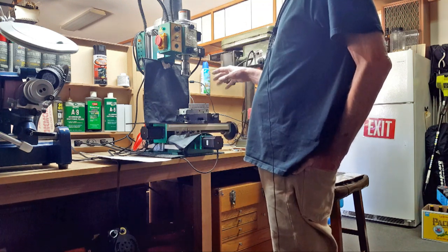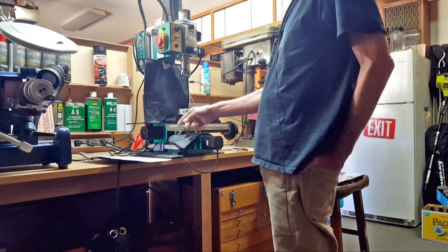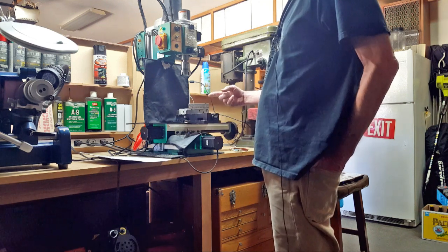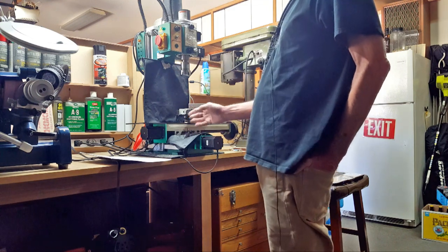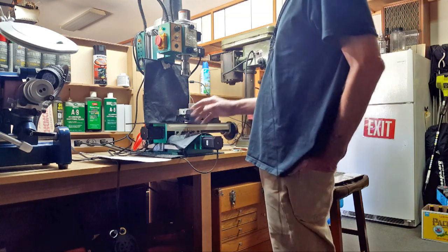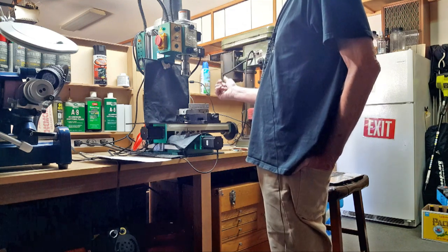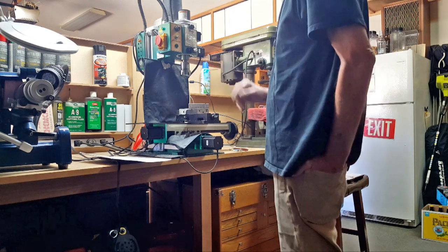Z is pretty good. On all of these axes, I'll tell you — the motor strength meant they were slipping because I never had flats. So I took the coupling off the X that goes to the lead screw, put a flat on it, and put it back in the flex coupling so it doesn't slip anymore. Same with Z — had to take it apart, put a flat on the shaft, and put it all back together.